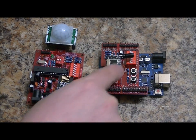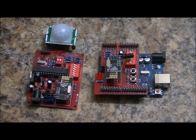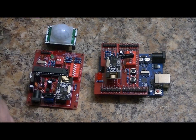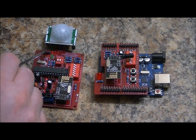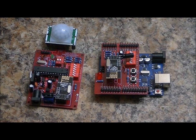You'll see that on the serial monitor when we load this in. We've also got some extra hardware here that's not utilized in the sample code. There's a 3-pin header — you can use a jumper to select high or low, 5 volts or ground, to one of the input pins. There's a 2-pin dip switch that's normally pulled high. You can add your own buzzer, and there are two more unused inputs you can access. You can create your own code and modify it however you see fit — I provide the sample code and you use the hardware however you'd like.